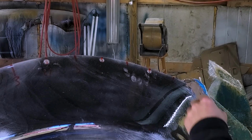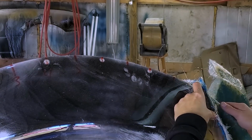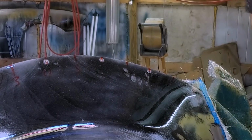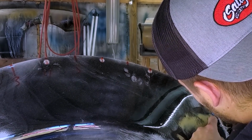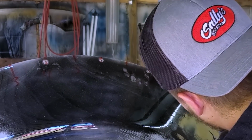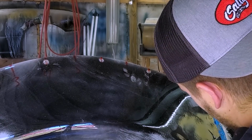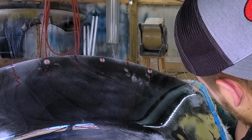All right. This comes off. The top flange up here does not feel very happy. All of this is wet. That's, oh no. Man, I just cannot win with this thing. The gel coat didn't cure. Why did the gel coat not cure? Oh, jeez. I guess temperature maybe. Maybe it was a temperature thing too.